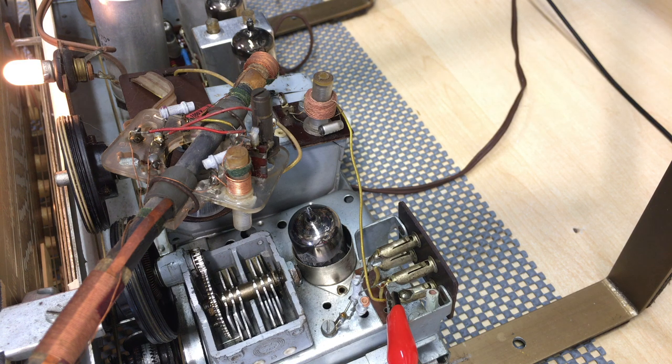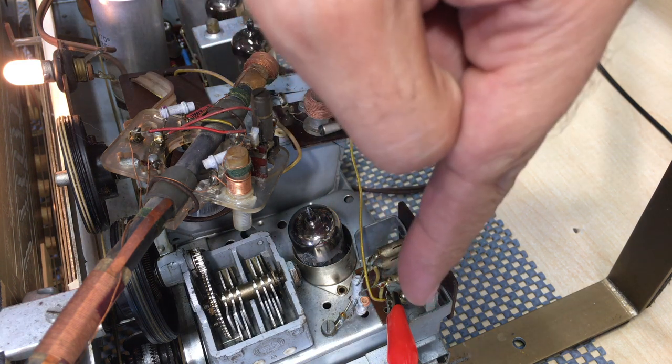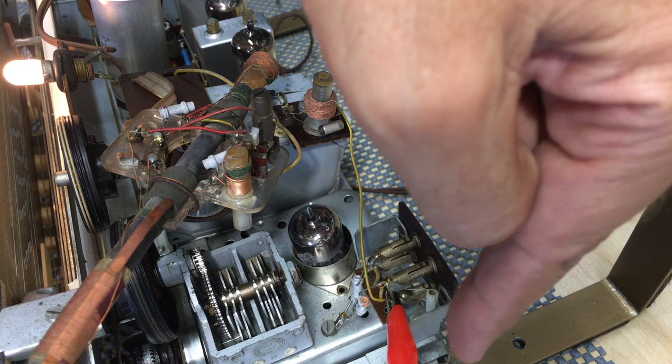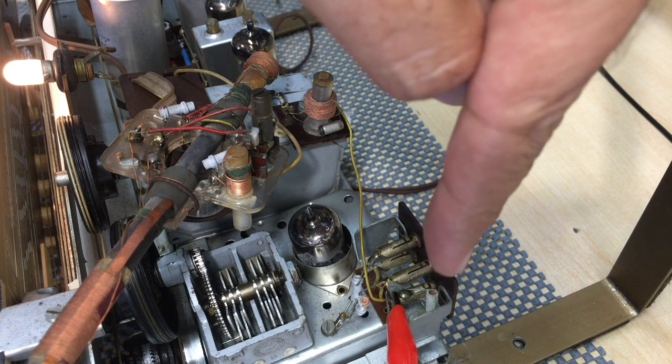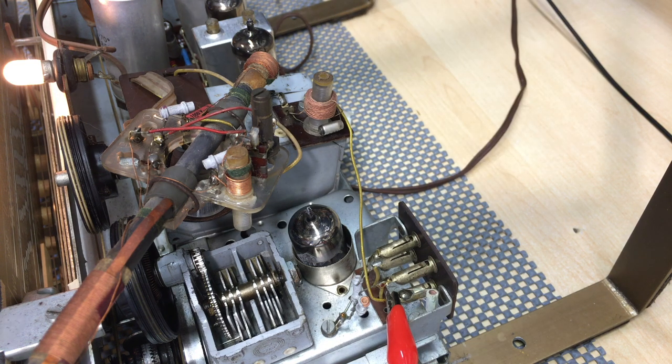of wax on there. Now what I've done is I've got the signal coming in, the same 460 kilohertz signal coming in straight to the antenna. I've got the attenuation at zero, so I've got 1.4 millivolts RMS coming in there. It's modulated to the 30%, but I'm hearing nothing. I hear the crackle, but no tone.